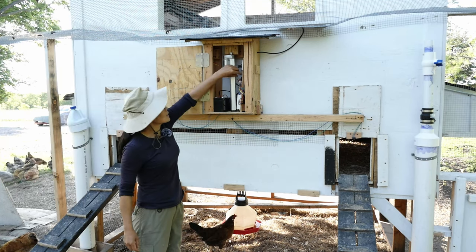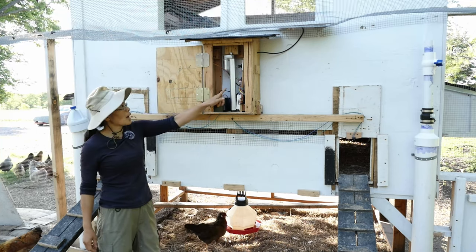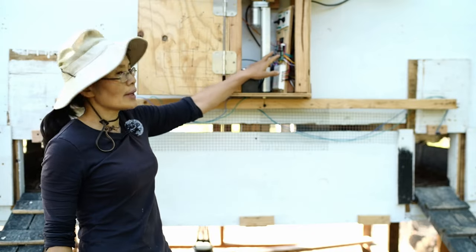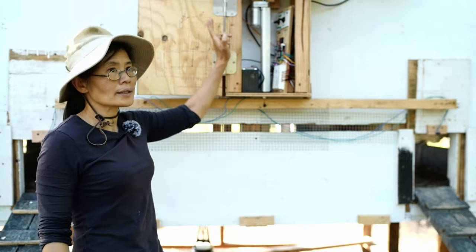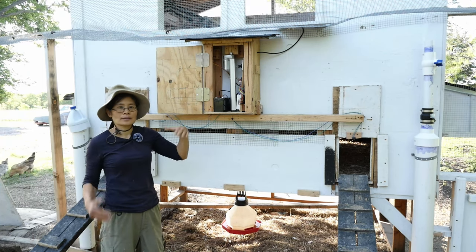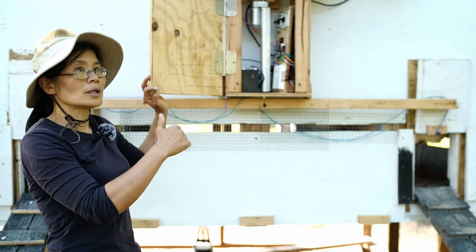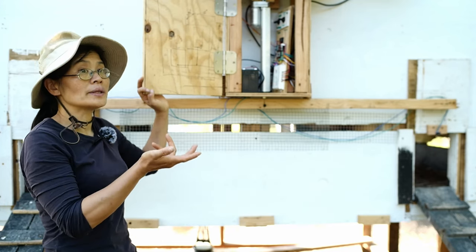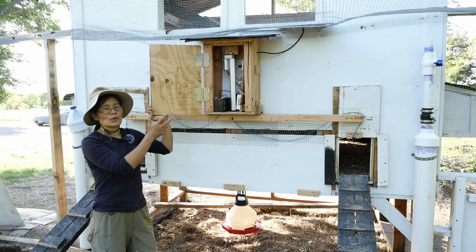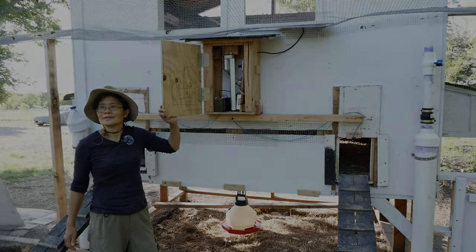What I'm going to do next is switch the control unit on. So now the microcontroller starts collecting data from the sensors and sends out the data through the XBee. I'm going to monitor it for one or two days to know when to set the threshold for the light sensor to control when I will close the door and when I will open the door. Next week, I'll come back with everything working and show you how it looks when it works.